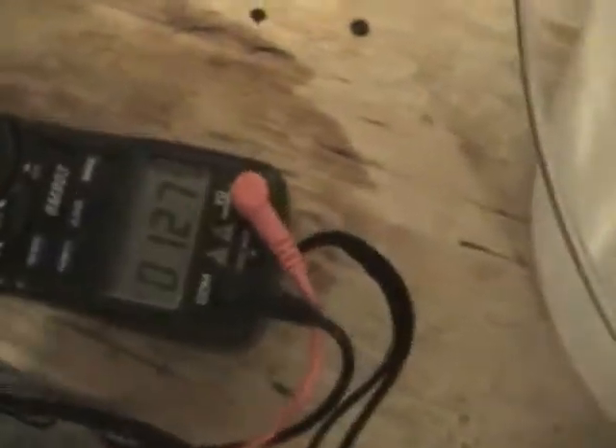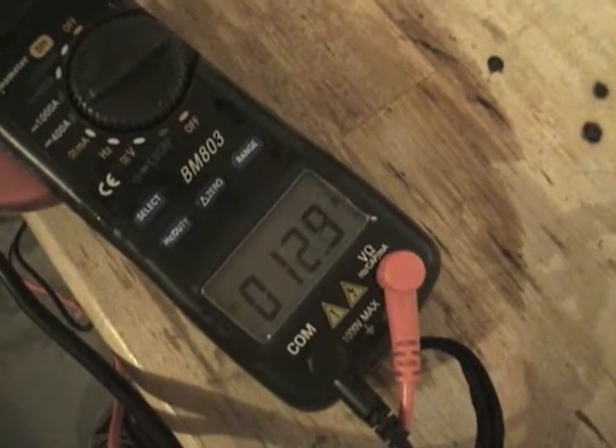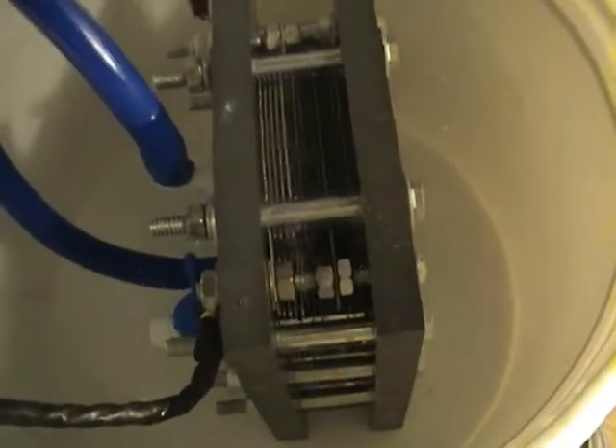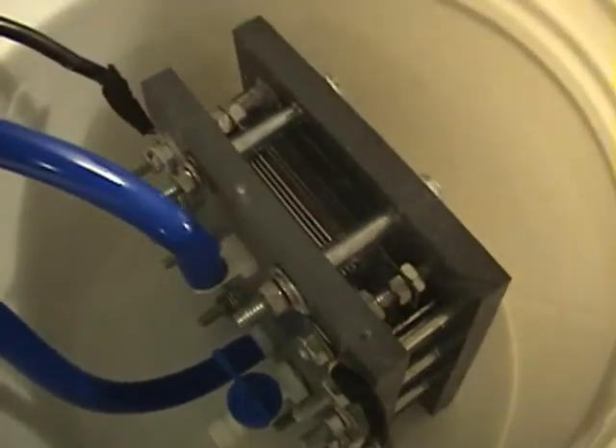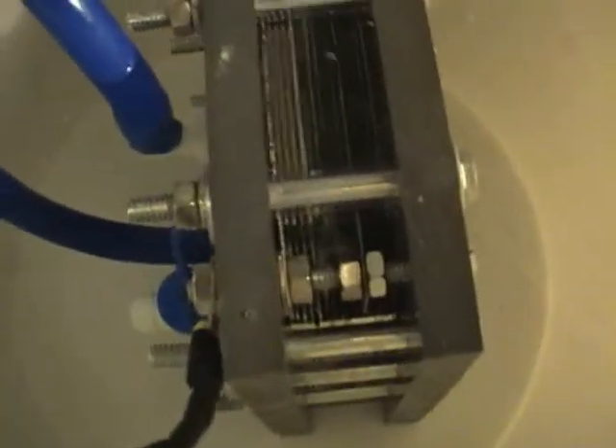Let's see — it's pulling about 13 amps, moving up a little bit. Let's just say 13 to 13.4 amps, completely submerged in water. This is my idea of what would happen if the unit was completely packed full of snow, water, harsh conditions. As you can see, it has no adverse effects on the cell at all — 13 amps. We don't have any shorting going on at all, and the unit seems to be running fine.